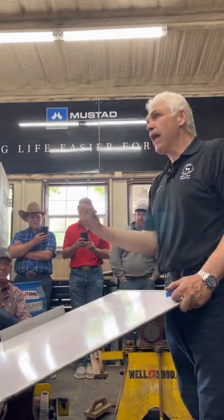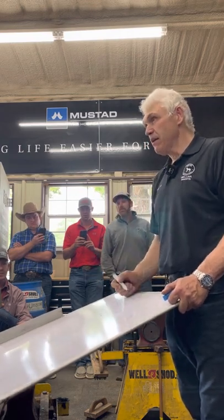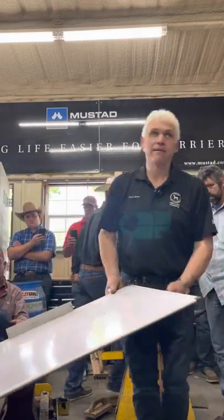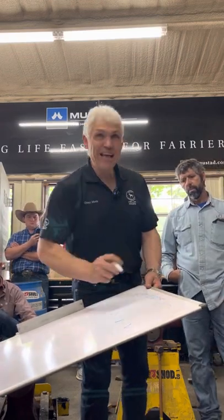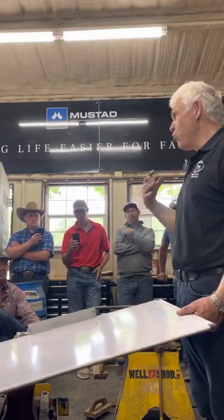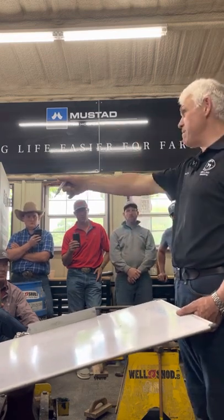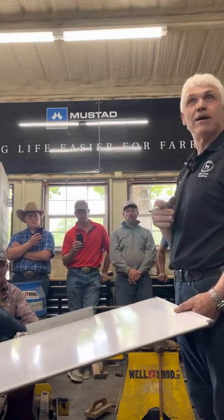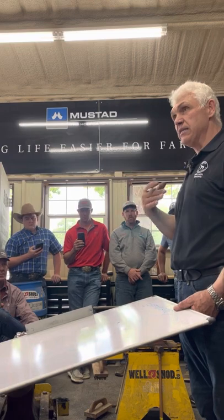So we calculate for our foot. We've got to take some measurements. And you know the most important word with measuring? Estimate. When you make handmade horseshoes, we take measurements and we estimate what we're going to cut. Because he might count 14, he might count 15, and they're both right, because he'll stretch more, he'll bump more. They both fit, but the estimates were right. So what you've got to learn is estimating.